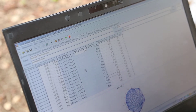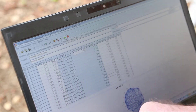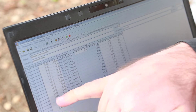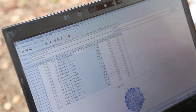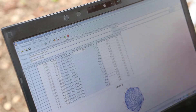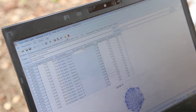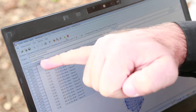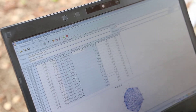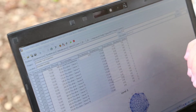To talk to the battery pack, make sure the green button is switched on. We can see COM 2 is opened. Now look at the Sensor ID column — it will be blank at first. What we do is tap any sensor just once, and then the serial numbers of all the sensors will appear in that column. Numbers have appeared in all the rows, which means all of our sensors are communicating with the battery pack and we're communicating properly with it as well.